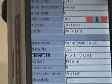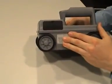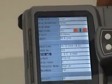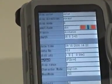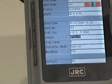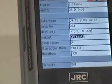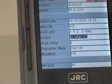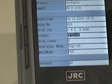The next point is the distance adjustment. The wheels on the HandySearch are rubber, and once they become worn, the unit needs an adjustment for the displacement — the amount of distance it travels. Generally you won't need to adjust this. The next option is output, with three options: cfbin, which is a compact flash binary file; compact flash text file; and the printing option. We'll generally leave the output on compact flash binary.